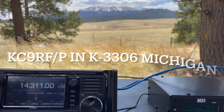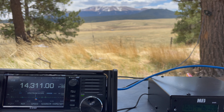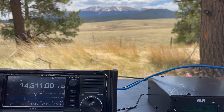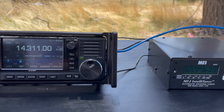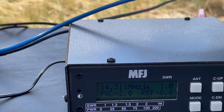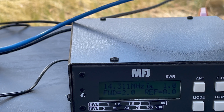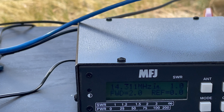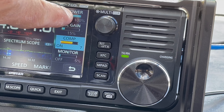There's a guy in Michigan - let's see if I can hit him. K0FYR QRP. Roger, K0FYR. Pretty good - just got him QRP in Michigan. Got an SWR, let me zoom in - SWR right here is 1-to-1. I was doing single sideband so it said forward power was 2, but that's SSB. The radio is putting out 100% 10 watts on the IC-705.